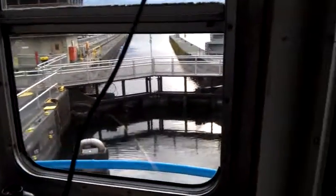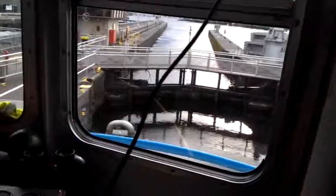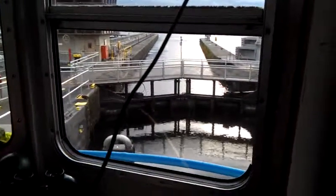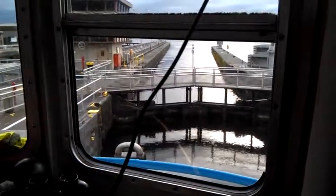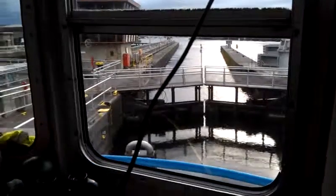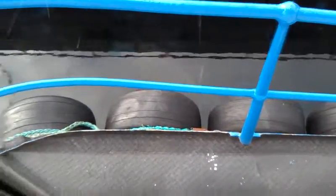We're not covered with rubber like us — look at us, you've got airplane tires all over the place. You can't really go wrong with airplane tires. They're the best to use for fendering because they don't have any steel belting in them except right in the bead, so you can drill holes in them a lot more easily than with a truck tire. Plus they're a little wider side to side for a given diameter, so that helps.